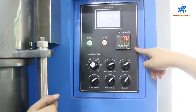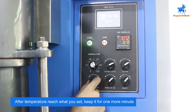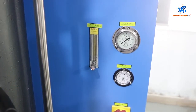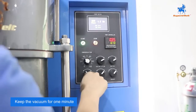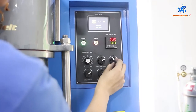After the temperature is reached, keep the temperature for one minute. After one minute, open the vacuum. This comes down to minus 0.1 — keep the vacuum for one minute, then close the vacuum and start granulating.